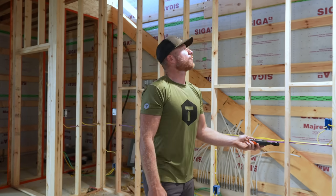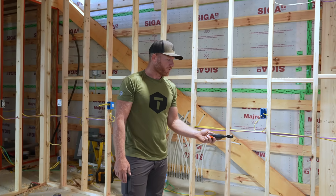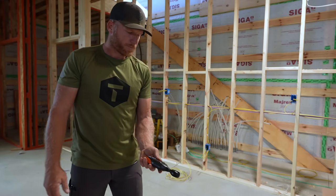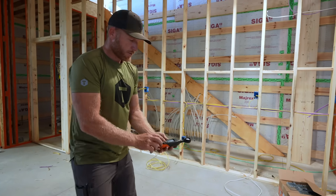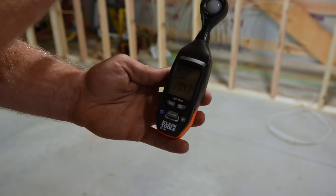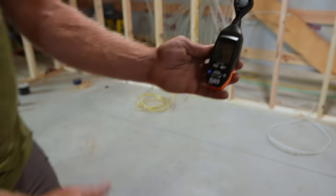Now, if I hold this right underneath of it, and you want to do it at like bench top height, I'm at 146 foot candles, right? I start to walk away, I'm at 88. So that's how quickly this light kind of dies off. 80. I don't know if you can see this, right? So that's like natural light, because I'm pointed away from the light now. We're only 15 foot candles right here. But as I walk in,